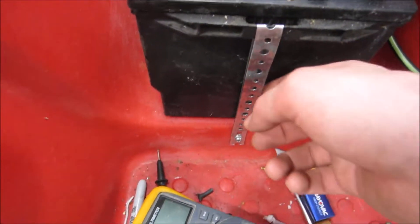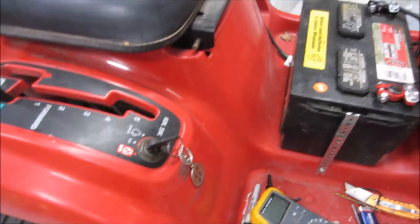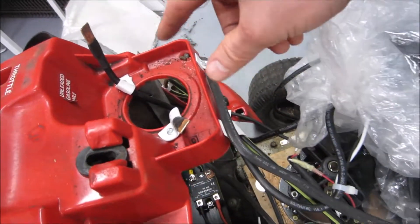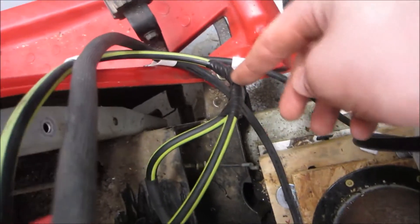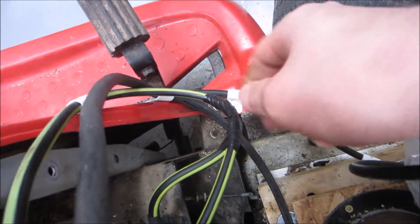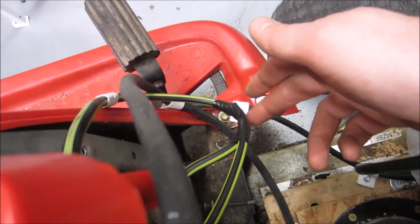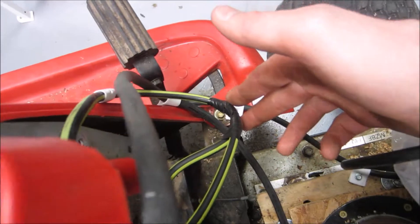The pipe hangers hold the batteries pretty well. I added two charging lines tied into the existing line using a piece of copper pipe that I pinched down with pliers. I used ox guard to coat the aluminum when mixing aluminum and copper to help prevent degradation from galvanic effects.